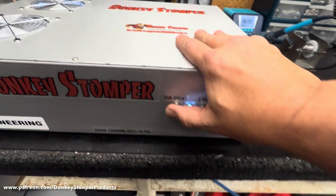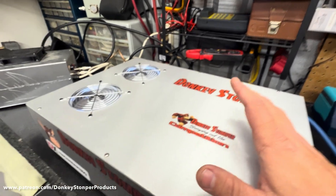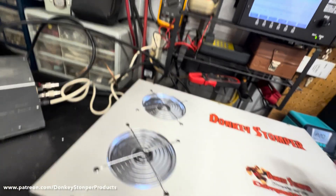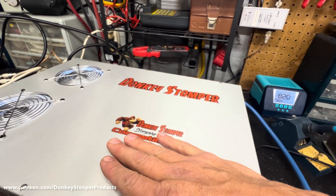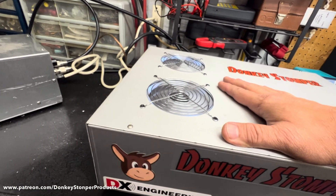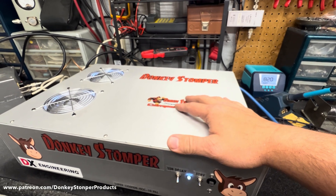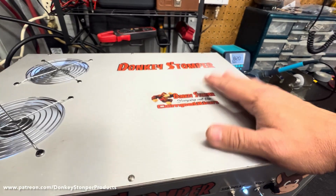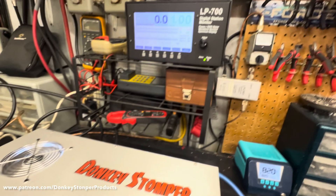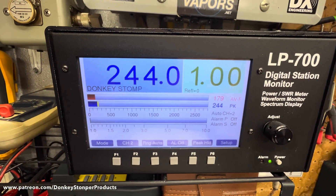This does have sideband delay - not sideband bias. We talked about this when we built it - you were going to maybe run a radio drive on sideband just a little once in a while. It's not really a sideband amp, but you could get by doing that. So you've got a 300-amp supply over here. You've got 10 2879 Cs, so your carrier needs to be about 250, somewhere in that neighborhood - 200 is a good carrier. Let me see what the carrier is set at - 244.